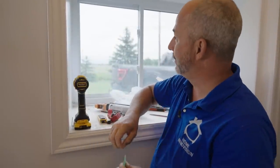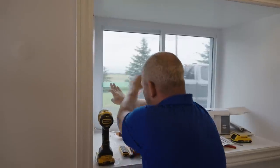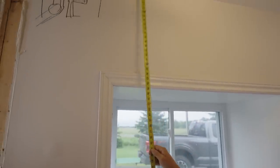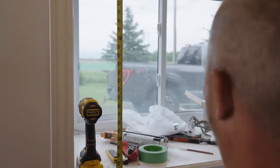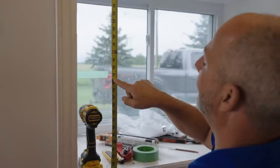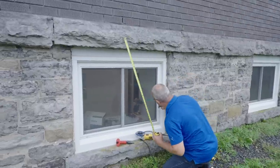What we're going to do is line up an eye line here, vertical off the side of the frame, right up to the middle of that cavity from outside, so I know where the middle is. I'll put tape on this glass right at my eye level and measure the joist — that's a nine-inch joist, so the middle is four and a half. I'm looking at 51 and a half inches, minus four and a half — that's 47. So I'm going to go outside with my marker, measure from that green tape, 47 inches up vertical. That's where I'm going to make my hole, on this vinyl trim.